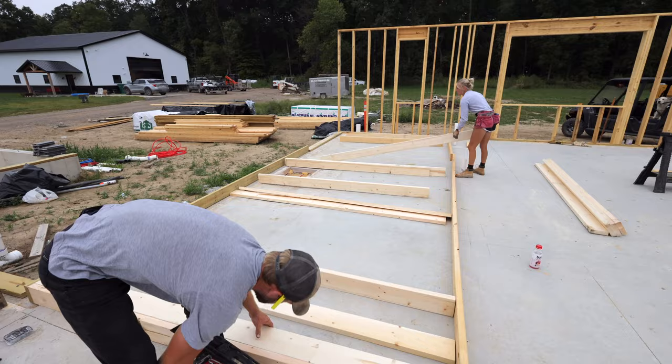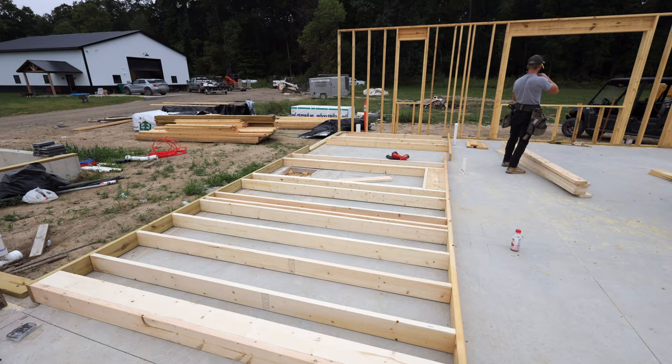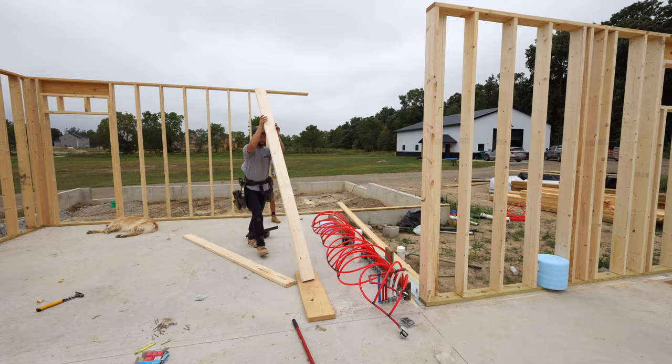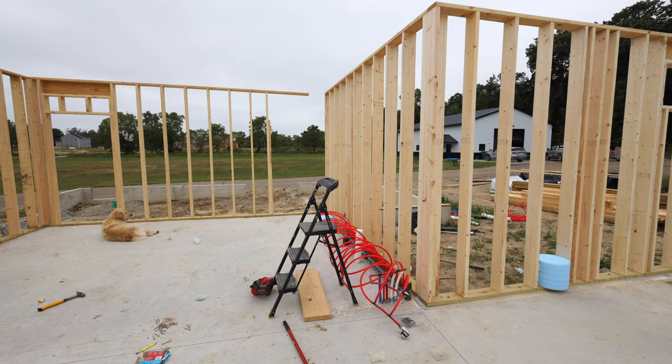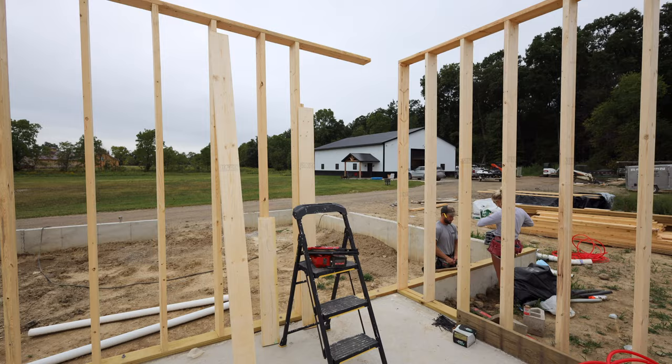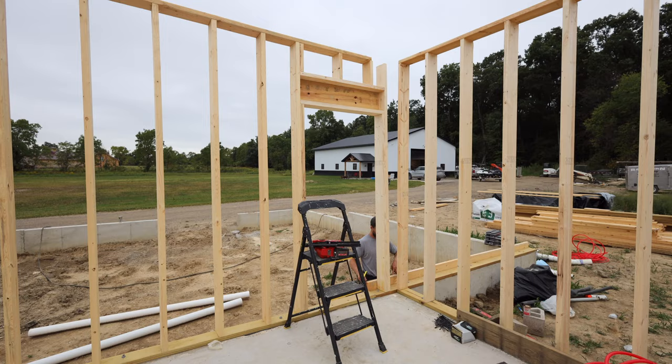You can see me laying out the top and bottom plate, putting studs out every 16 inches except where the wall is going to intersect on the inside or at a window or door opening. It went pretty quick. We just stood up these two walls — this is going to be our master bathroom and closet wall. With the in-floor heat, we couldn't really stand up a wall so we just framed it in place, and it was actually pretty easy. So we decided to do the whole garage this way because the garage is so far off the ground we couldn't really lift the walls up without bracing them like crazy and using a machine. It took a little bit longer in my opinion, but it should actually be stronger because we toenailed everything except the top plate.